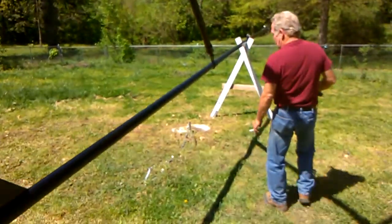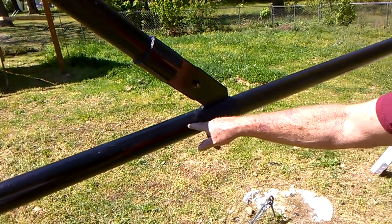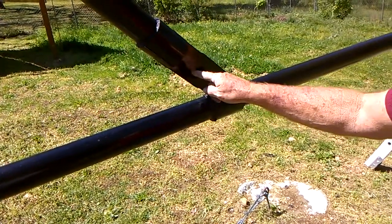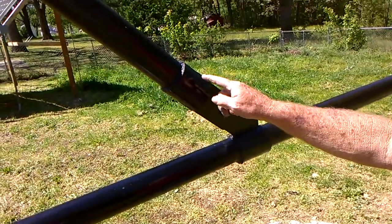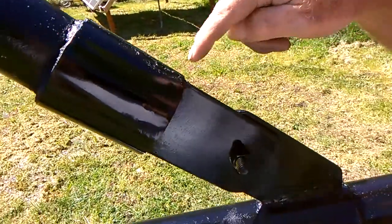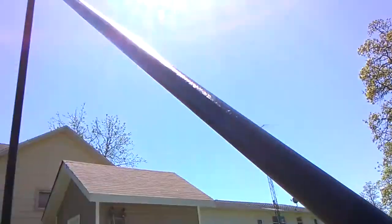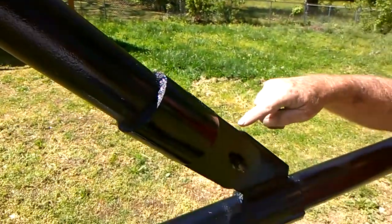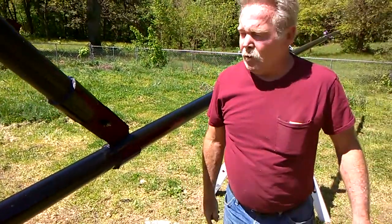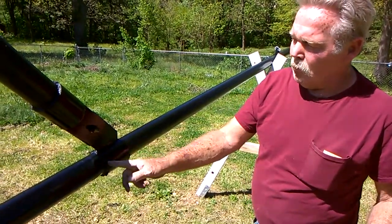Come down here and I'll show you. I fabricated a few little things here that made the attachment easy. I made a piece of three and a half inch pipe that goes over this three inch pipe. I took some quarter inch stock, cut a 45 on it and rounded it off. On this other piece, I took another piece of three inch pipe and notched into the side of it on both sides. I put this piece inside there and welded it in and on the inside. This slides over the pipe and we welded it in place, and did the same thing up on top. This piece will still pivot, and we can line these up. We put a speed square in here — made a perfect 45 when we had the measurement just right. It's a perfect 45 up on top. This could slide in and out so we can adjust it until we got the spots set just right, then we went ahead and welded it in place in two spots.